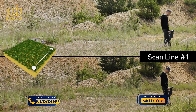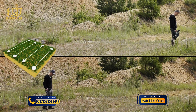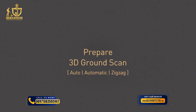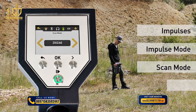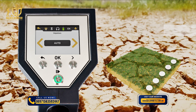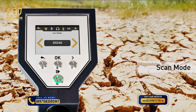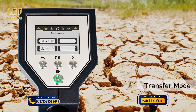3D ground scan can be performed in parallel or zigzag scan mode. Experienced users who want to scan even faster may use the zigzag mode. Select 3D ground scan and adjust the parameters: impulses, impulse mode, scan mode, and transfer mode. Set the number of impulses — we recommend auto. Select the impulse mode automatic, where each measure value is recorded continuously without any breaks. The scan mode defines the direction on the scan field; for faster scans, choose zigzag. Finally, define the type of data transfer: choose memory and select a slot to store the measured data in the internal memory of the Rover C4.